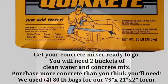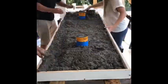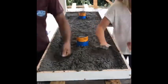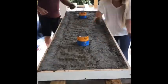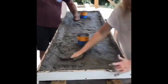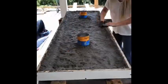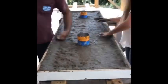Mix your concrete with water — you can rent a concrete mixer from Home Depot or any other home goods store. Mix until it is like a really thick milkshake. Once thoroughly mixed, begin filling in your form, pounding the concrete in so it is nice and tight. You can use a board or a hammer; we used our hands but after a while it started to hurt, so I'd recommend using a board instead.